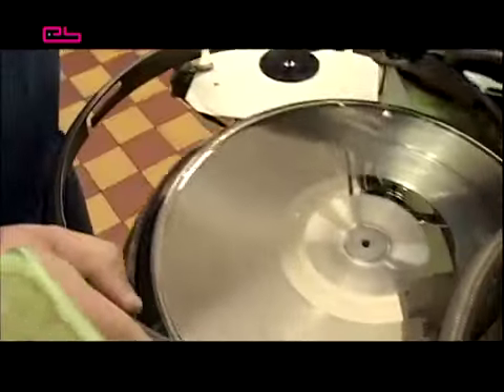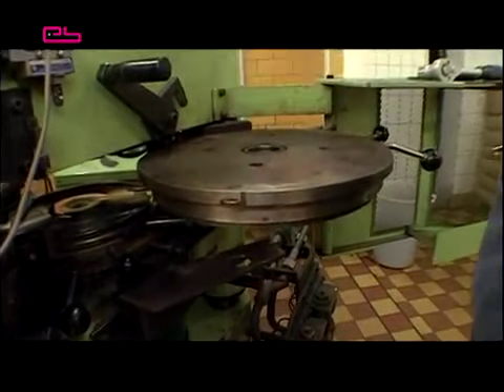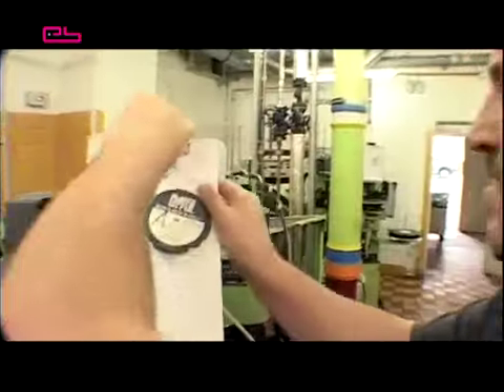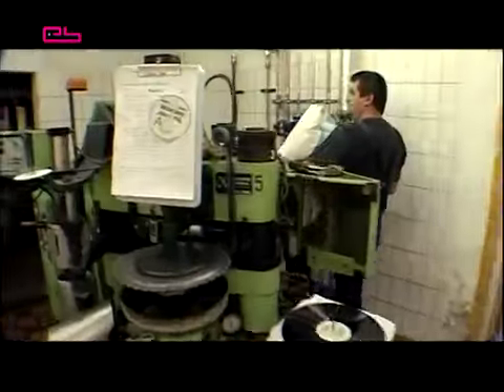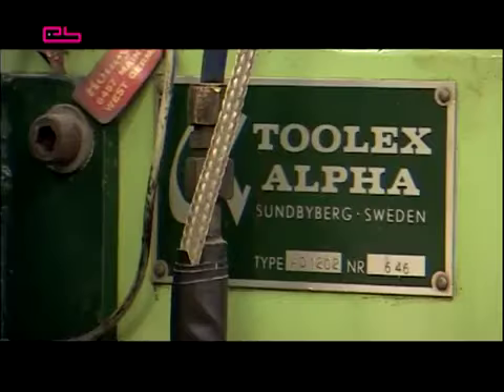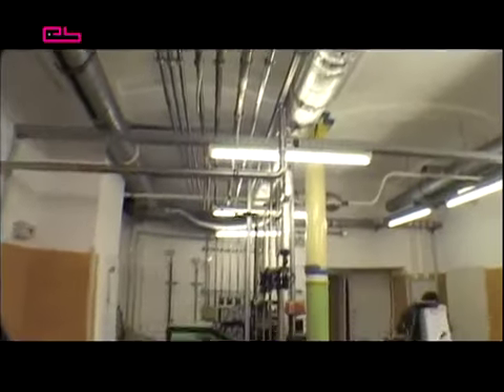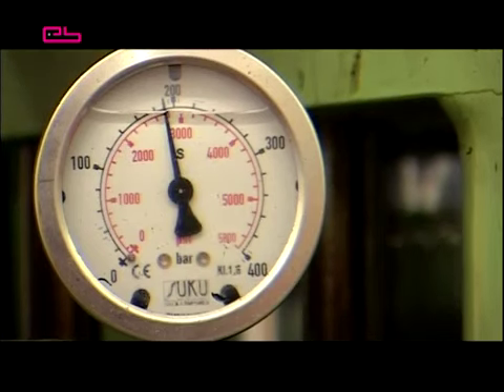The finished stamper is clamped into the mould of the unit. For each side, one pressing matrix is required. Then a granulate of a synthetic PVC compound in viscous form is put into the so-called extruder and formed into small vinyl cakes, which are put into the press. The cakes weigh about 160 grams and have a temperature of 160 degrees Celsius. The mould is steam-heated to 180 degrees, which liquefies the vinyl cake. With the use of hydraulics, the press tools compress the vinyl cake at a pressure of 110 tons. In this way, the grooves are pressed into the vinyl, and by means of the groove guard profile, the round form of the disc emerges.